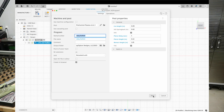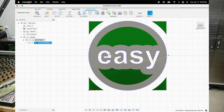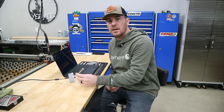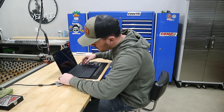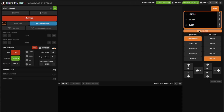We're going to go ahead and hit Post, and you can see the NC code successfully posted. Now we can get out of Fusion 360 and open up Fire Control, which communicates with the Langmuir Crossfire table. Now that we've got Fire Control opened up on the computer — it doesn't register anything or allow any functions until it's actually hooked up to the controller on the plasma table. To do that, just take this USB cable and plug it into the laptop, and once we do that Fire Control will become activated and we can start moving things around.